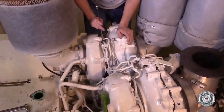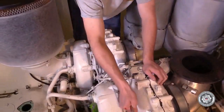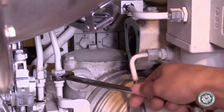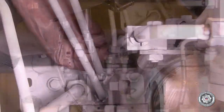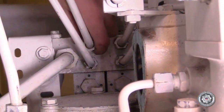Remove the coolant vent lines and lube oil supply lines that are all together like a spider — we actually called this the spider when we pulled it off the engine. Again, it's best to pull it as an assembly, and as a reminder, take pictures before you remove all this stuff to aid in putting it back together when you're done.